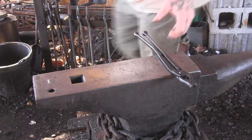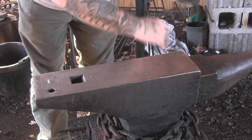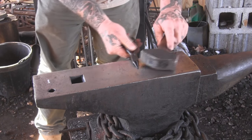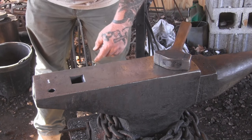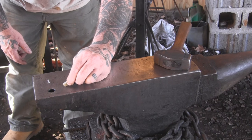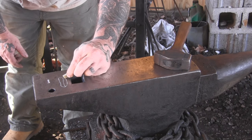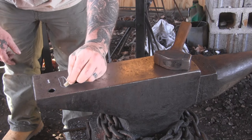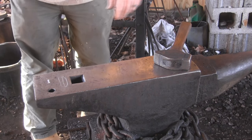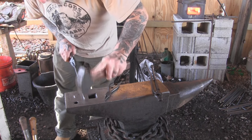I think what I'm going to do is make this a little bit of an S-style. An inch and a half is what I need on the width, and then I'm going to try to forge weld and tack it together. Let's look at getting this thing bent initially first at our inch and a half mark, get our S — when I say S, I'm talking about something that's going to look about like this when we're done. Let's get our initial bend in this thing, just a little bit from there, and flatten it out.